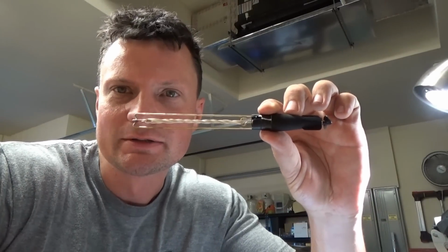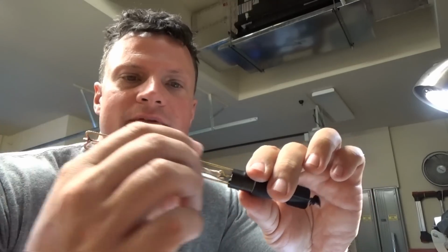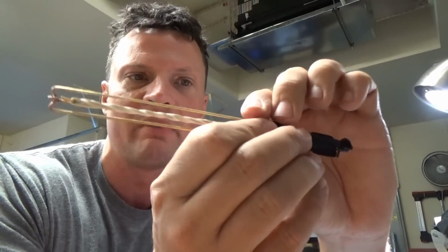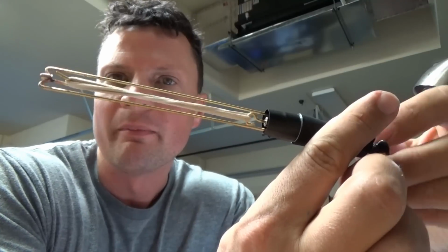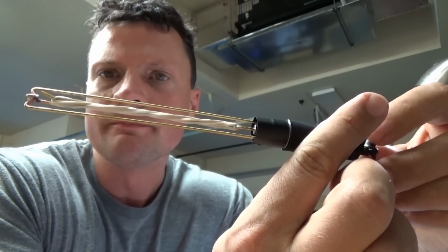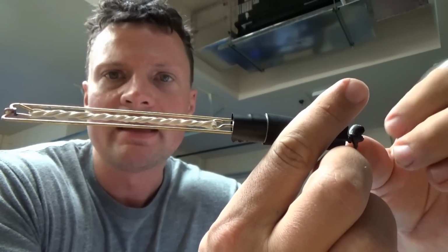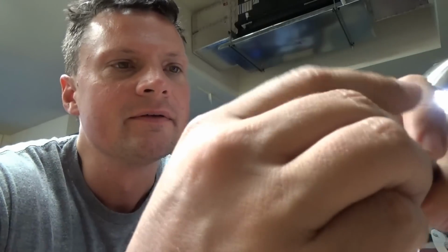All right, let's take a look and see what I managed to get put together. This is the finished assembly for a rubber band powered torpedo. You can see you've got a 1/16 of an inch brass rod framework that I've got a couple of elastic bands wound around. I can wind up my propeller here, and once you get the adequate tension on the elastic band, it flips the prop, and actually it works fairly well.